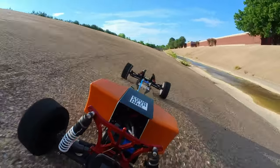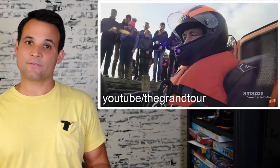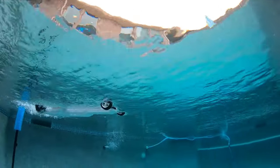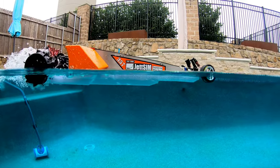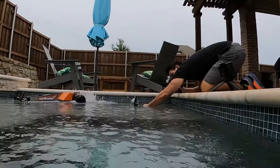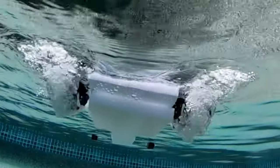There are some things I want to improve. First, I think it would be awesome to add a jet motor onto the back that I just turn on when it's in the water — very similar to the amphibious car that Clarkson broke the amphibious car speed record in. I would also like to reduce the drag on this design. I was quite limited because I needed enough foam to actually keep this thing floating while it sits still, and that requires displacing as much water weight as the whole weight of the car. So if my car weighs six pounds I have to displace six pounds of water to keep it afloat, and that put a lot of surface area and frontal area underneath the water, which made it really tough to get any sort of speed.